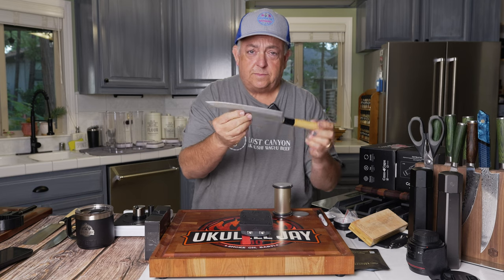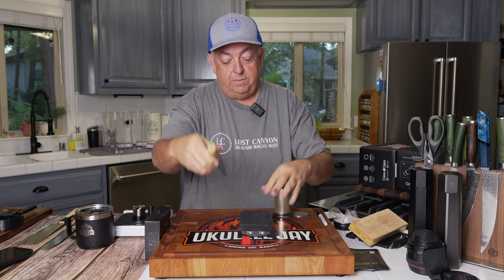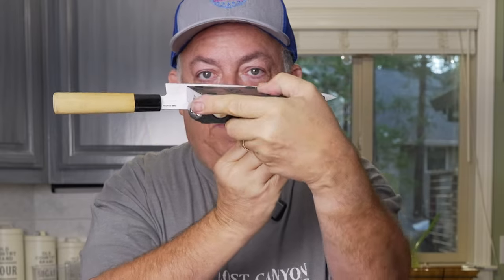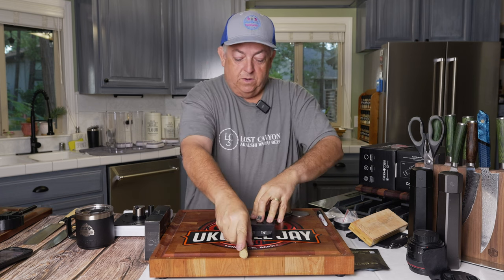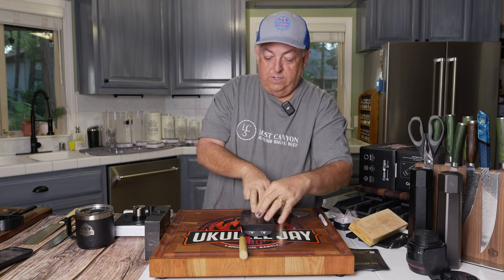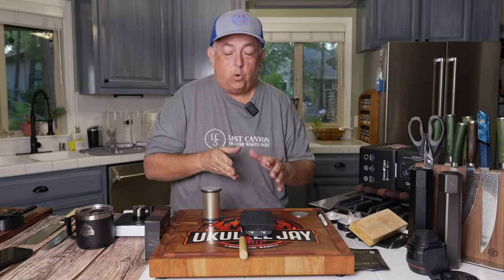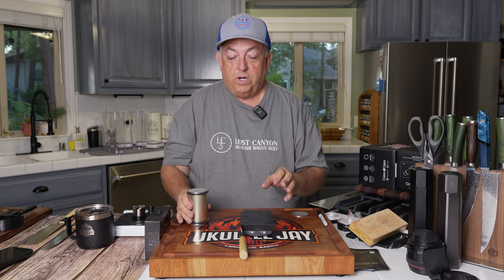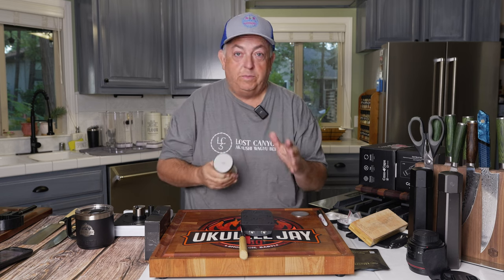With this single bevel, you have to make sure it goes on properly — it's only one side. I'm going to do it with the handle away from me. I put the blade right on here, and I'm at a really nice position with the blade coming up on both sides so I can use the Hone. The handle is down, all that metal is exposed. I'm starting with the 700 grit. Remember, we don't rotate this — it's going to be one side only. There's no going back and forth to remove a burr; I'll show you what we do about that.